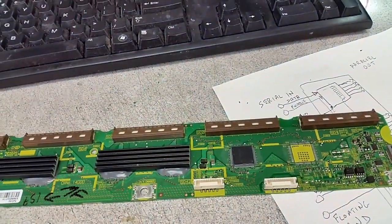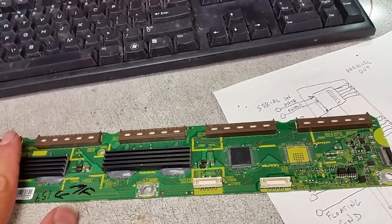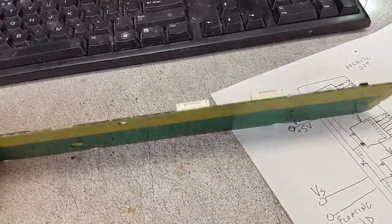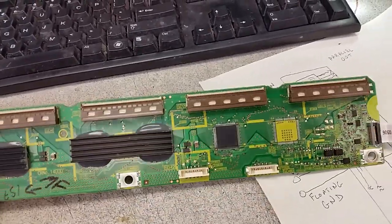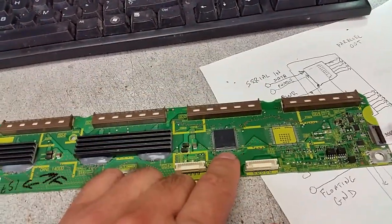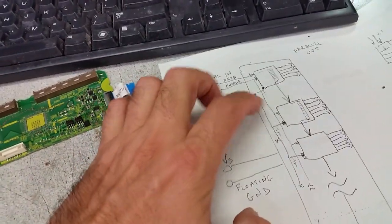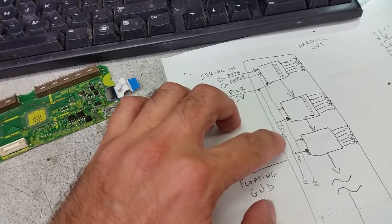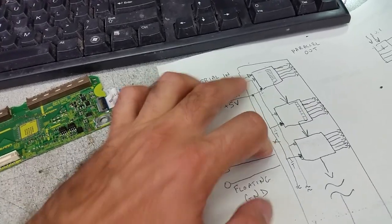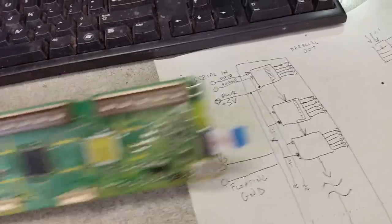The problem with that approach is it works well when there are no heat sinks. There are buffer boards without heat sinks. Another way is to go with an infrared camera. Sometimes it works, sometimes it doesn't. This is basically the most reliable one, the one with isolating. And if this was properly designed, it would have had jumpers at proper places here so that one can easily separate. You wouldn't have to cut through tracks like that. All they had to do was just put a jumper between every pair of two, and that would easily allow narrowing down things. But almost nobody does that.